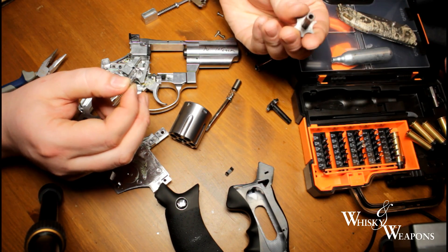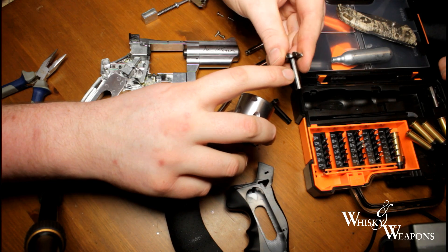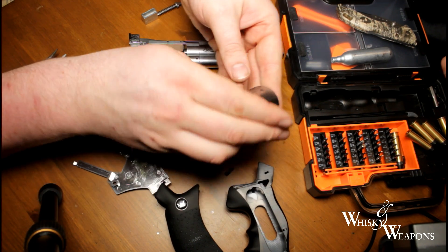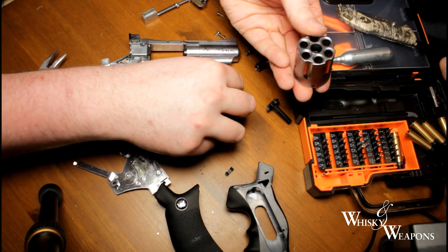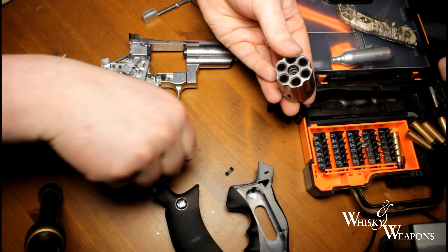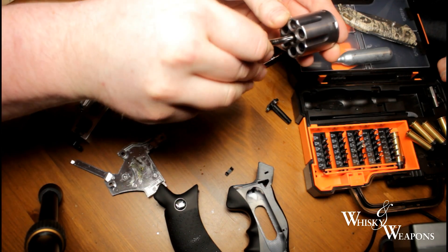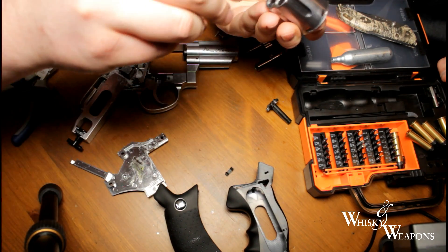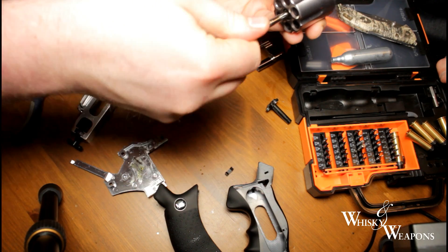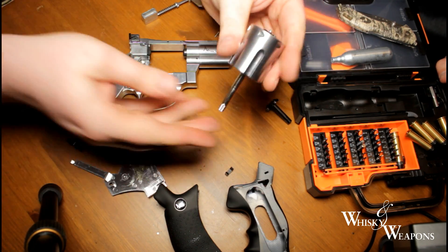Here's the new one. We've got our pin in first, followed by the spring. There's a little groove either side - I'll just slot it in there. There comes the pin and spring out again, so push those back in. That's going to slide in like that and then this is going to screw back into position - with the washer we need that on too. I'll screw that back into position. It's a left hand thread so it goes against the grain. I'm just going to screw it out again because it doesn't feel like it's going in right - just make sure you get those threads nice and lined up. That's locked up lovely.